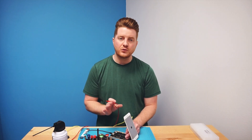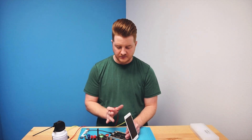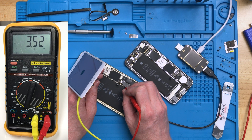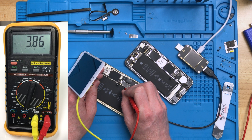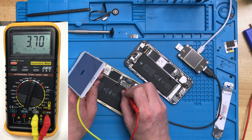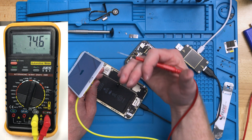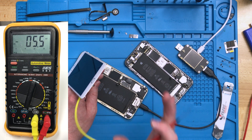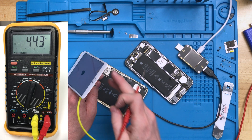When used in combination with a Smart Mod Pro TriStar tester you can really weed out the devices that are truly TriStar failures versus ones that really aren't. This is an extremely basic skill that even the most entry-level techs should have. Doing the reading one more time: using our left hand to touch ground with our black probe, we take our red probe and touch the furthest left pin on the battery FPC — we see about 3.5 to 4 volts. It does cycle because the phone is power cycling, which is completely normal.